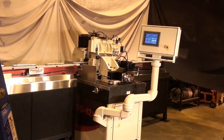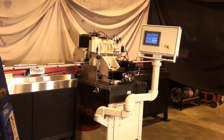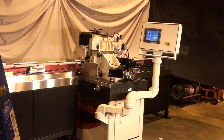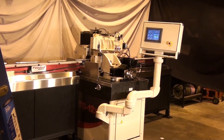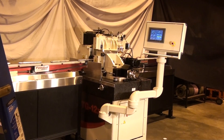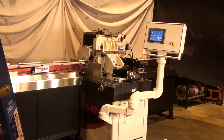The operator sets parts on the entrance conveyor to keep a continuous flow of parts entering into the grinder. The grinder is set up with a long guide and blade assembly to support the 12-inch long, 1-inch diameter parts. As the parts exit the guide and blade, they are moved away from the machine by way of the exit side dual band conveyor.